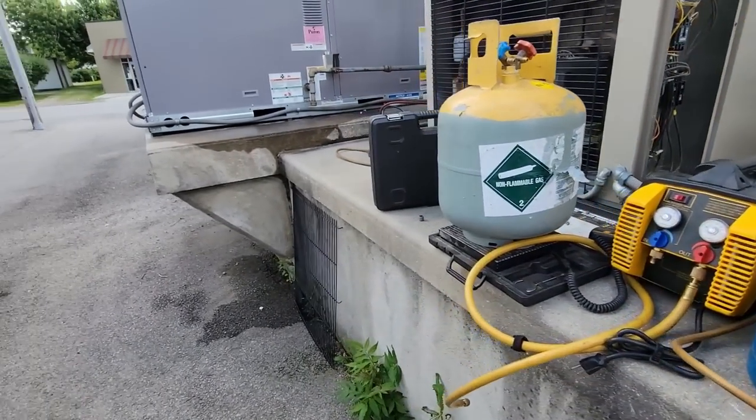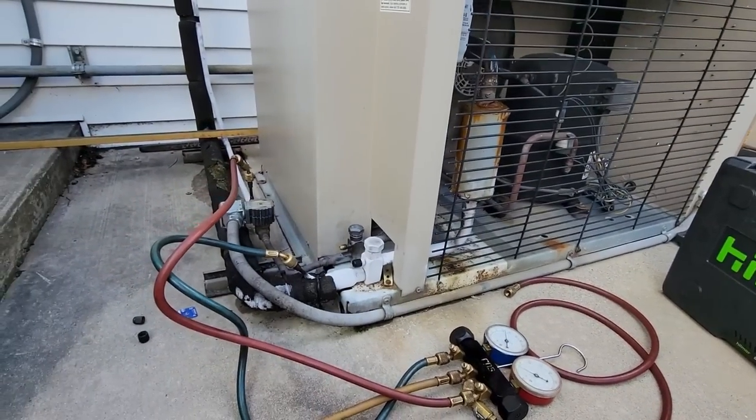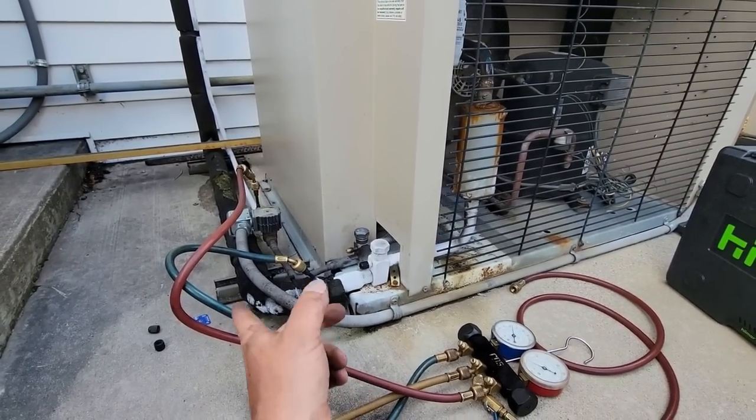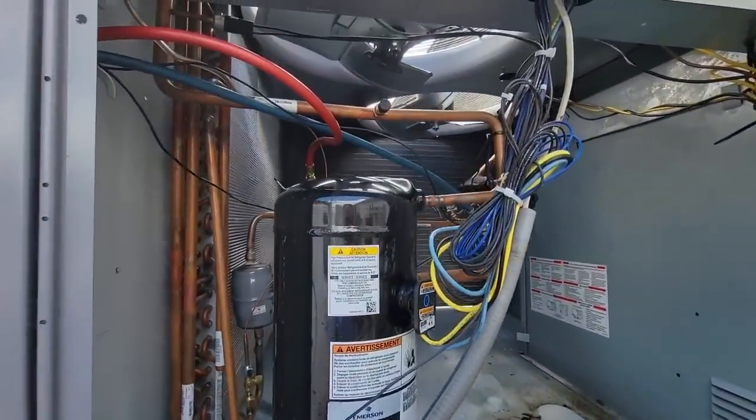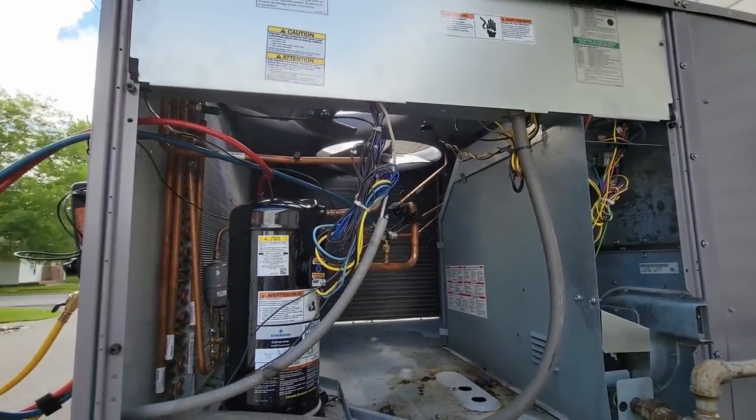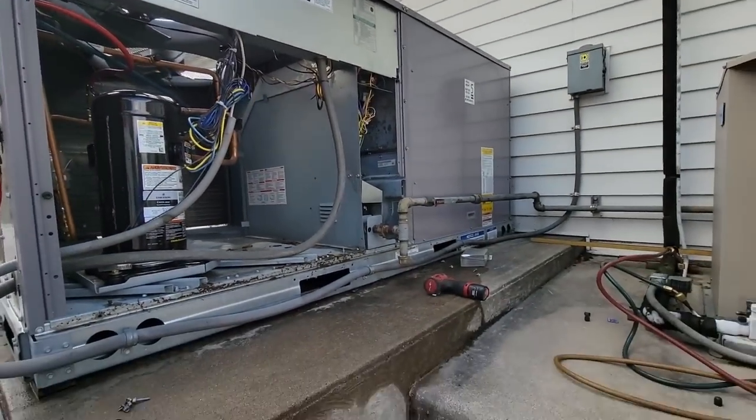While it's doing that, let's go over here and look at this. We're starving this system — it needs a new solenoid on it, I'm going to have to do that. From R410A, got the probes hooked up to the liquid. We'll go ahead and run it. The pressure seems up, so it may not be what I was originally thinking.